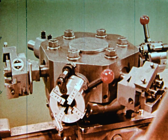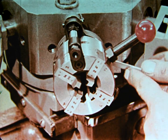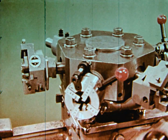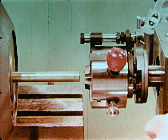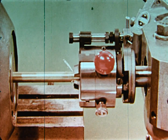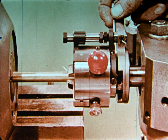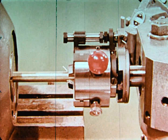An aligning shank, which can be used to compensate for misalignment, is an available feature on stationary die heads. The two square head screws at the rear are loosened, allowing the head to float freely. Then the head is fed to a true running work blank until the chasers are fully engaged. The machine is stopped with the chasers still engaged with the blank. The binding screws are tightened and the job is done. This feature results in increased accuracy and reduced downtime.